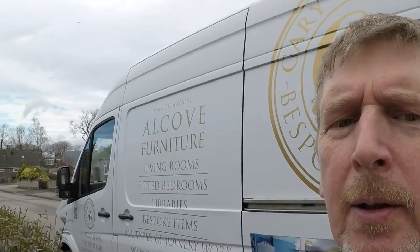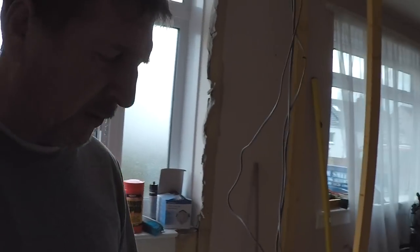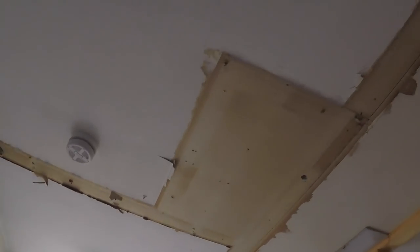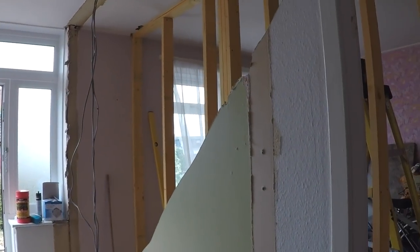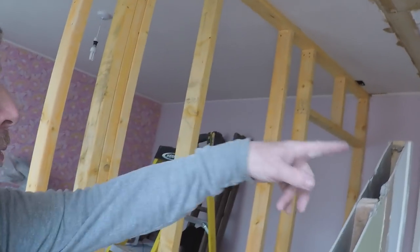Good morning YouTube, just started this job at this house here. From the outside it's just a wee house, it's gonna get a loft conversion. There was a door here, a vegetable door - not a carrot - and a wee cupboard. When you look up at the ceiling there's a shape, so I knocked all that down. This partition I've just cut because that's where my staircase is gonna go, and I put up this new partition because that's where the staircase goes against. I'm gonna cut a big hole out, put my staircase in, and I'll make that back at the workshop.